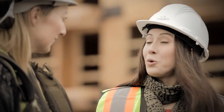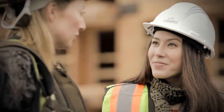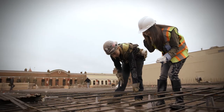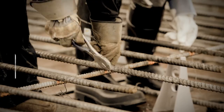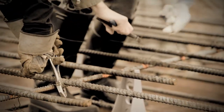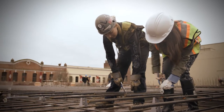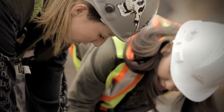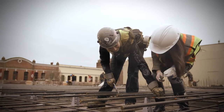So I've got a piece of wire and I've got a tool — what are we doing? Those are called pliers — that's our primary tool in rebar. You're going to put that wire around the bottom of your carry bar right here, grab it with the teeth of your pliers, and cross over. Keep twisting it in the same direction. This can be dangerous because you can break your wire. I broke the wire! Yeah, but it's still holding. It's good.